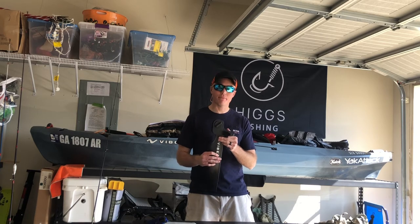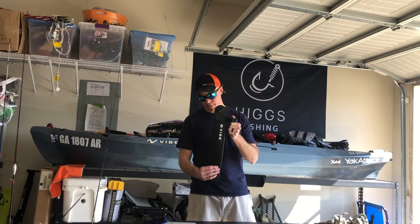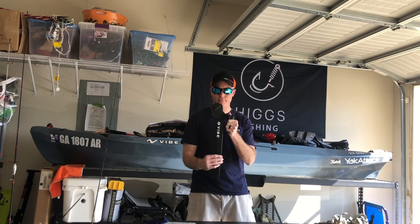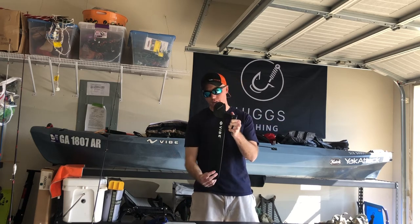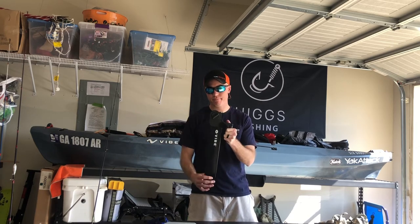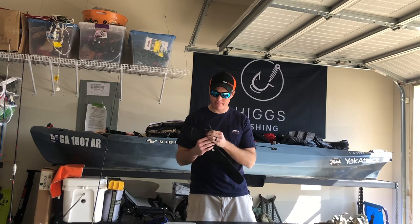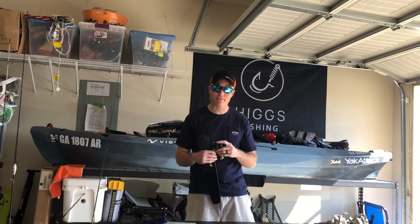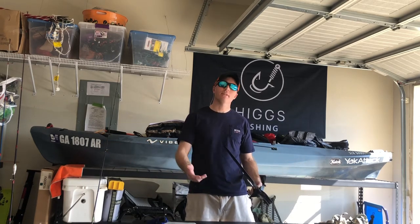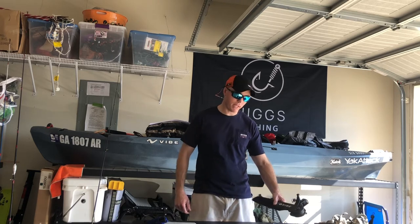The reason for the Vibe gravity rudder versus this rudder is — and I'm going to try to see if I can't find a way to DIY this. This rudder comes like this. When you release it to go into the water, it's going to flip all the way around. When the motor is put in reverse, it's not locked, so it's going to kick straight up — it's not going to let you use reverse. Does that matter to me? Not really. I'm going to use the Yellowfin basically for me and my wife because it's a tandem, and also as a large heavy hauler for things like crappie fishing. If I can't reverse, that's not going to kill me. I just need to get on the crappie and put the anchor down — I'm really going to use it to travel from spot to spot.